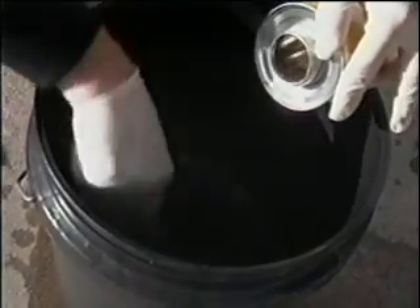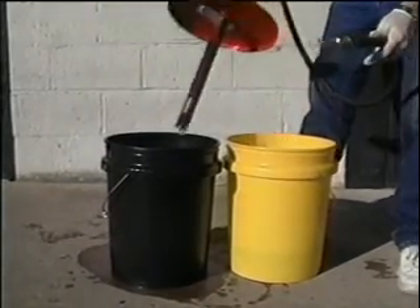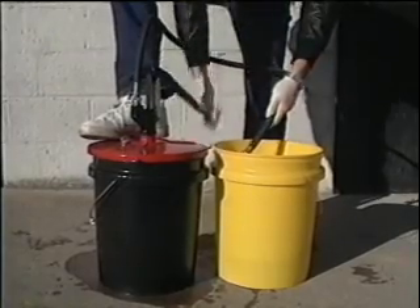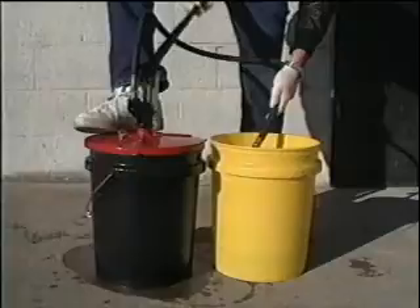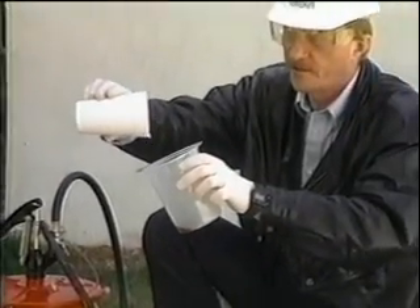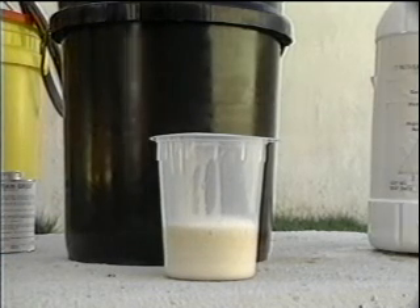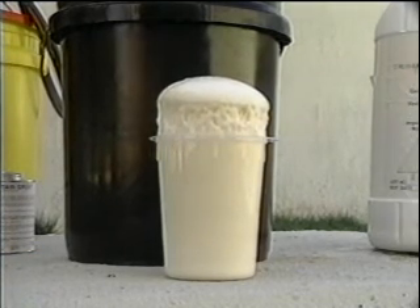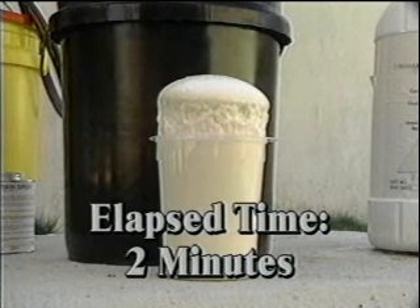Once the grout is activated, we're ready to put it in the pump. Put the output hose into a container to collect the pump flush that will be flushed out. Start the pump and watch for a color change to indicate that the pump flush has been expelled and the grout is now flowing through the pump. A small amount of pump flush that might mix with the grout will not hurt the mixture. At this point, it is recommended that you check the reaction time of the mixture. Pump a small amount of grout into a plastic cup, add a few drops of water, and stir vigorously. Time how long it takes for the reaction to occur — for a standard mixture, it should take about 30 seconds to begin and another minute and a half for the material to become fully expanded. This will allow the grout to travel deep into the crack or void before the reaction occurs. If the grout reacted as expected, it's ready to use; if not, add more grout or accelerator to obtain the desired results.